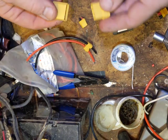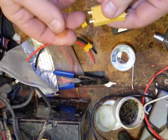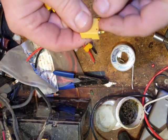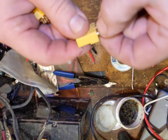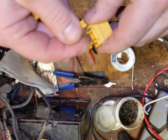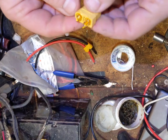It makes a good solid connection and it doesn't have a corrosive flux. I have electrical solder but this stuff is nice low temperature, which makes it very easy to work with. A lot of run-of-the-mill soldering will want too high a temperature, and with these connectors what will happen is you'll heat up that barrel and it'll start to slide through the connector because it'll start to loosen up and float — you don't want that.